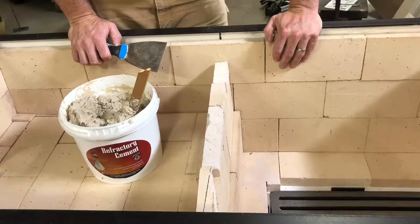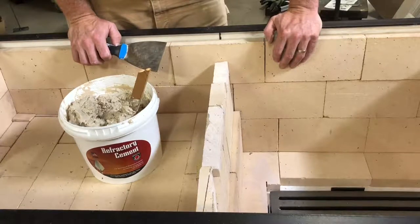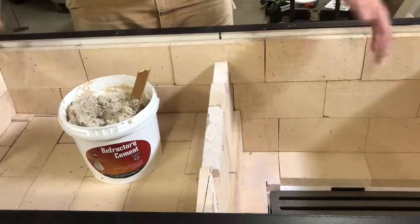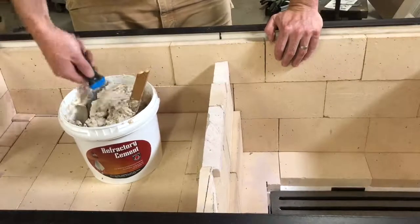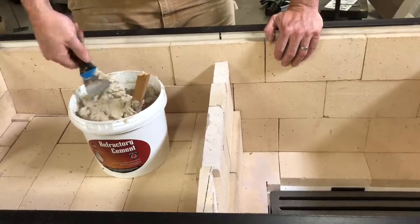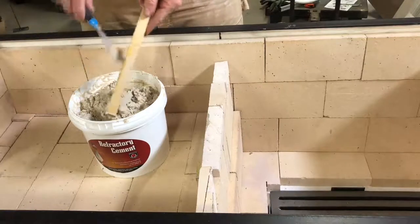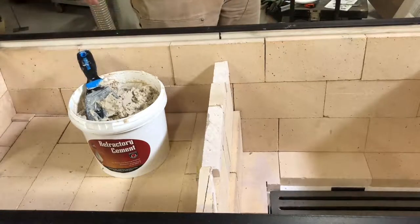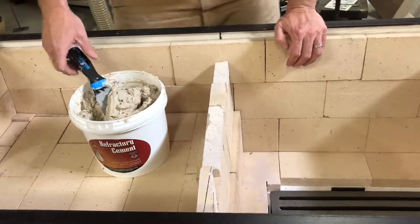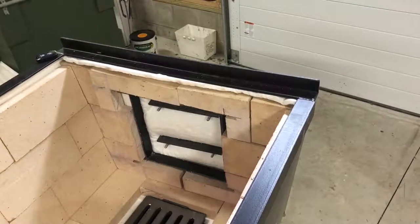The few exceptions will be the very front, and I think that's where I'll start. I want to make sure the brick stays put, especially in the front and in the back — both are vertical. The sides have a lean. I've got the refractory cement all mixed up. It comes in a tub ready to roll. The liquid had come to the top so I got it mixed back to a uniform consistency. You can see the bricks have some space in there.